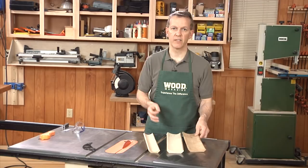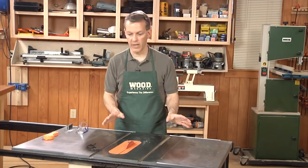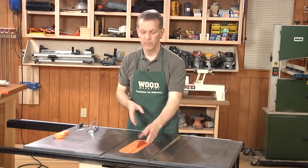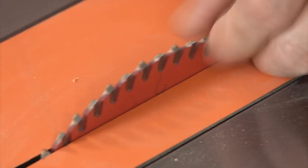So how do you make these curved cuts on the table saw, which you typically think of as making just straight cuts? First, a little setup: you won't need the rip fence, you won't need your miter gauge, and if your saw has a riving knife, you'll need to remove that as well. For a blade, I recommend the higher tooth count the better — the higher your tooth count, the smoother the cove and the less sanding you'll have to do. I've got an 80-tooth crosscut blade in here, which gives a pretty smooth finish. Still some sanding required, but not nearly as much as with a 40-tooth combination blade.